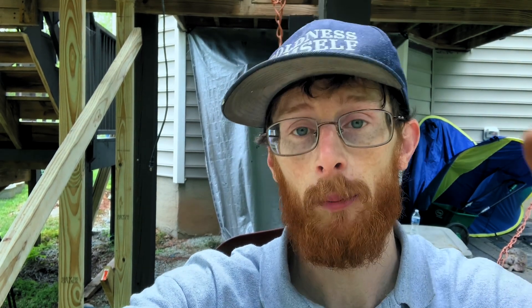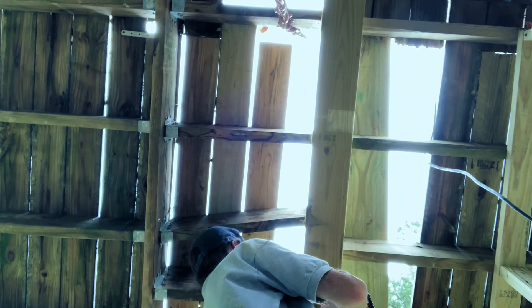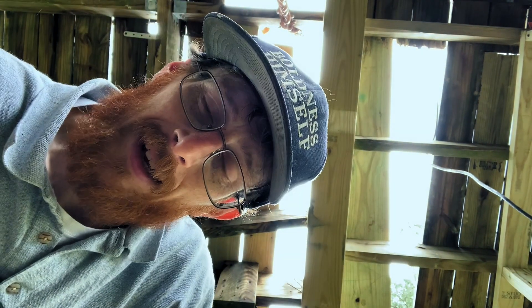Now since I'm just one guy out here doing this thing by myself, you learn to do stuff by yourself. The way I'm going to put this really heavy thing in is from the top — I'm going to take a deck board and nail it underneath here, like this. Now I'm going to put that joist in from the top and it'll rest on that thing so I can screw it in.